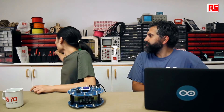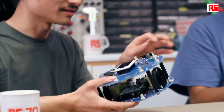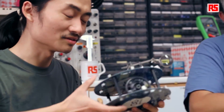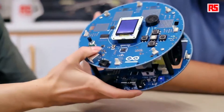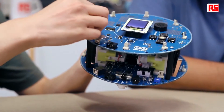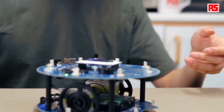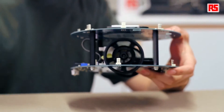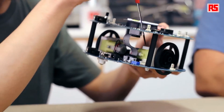Let's first find a small screwdriver that will be necessary for calibrating the robot. As we talked about before, the USB cable actually disengages the motors, so you have to unplug it first, otherwise the motors won't run. Now let's turn on the robot. You can see the robot is running very fast — you can adjust the speed by turning this potentiometer. Let's slow it down a bit, then put it on a flat surface to see if it goes in a straight line. You can see it's turning to the right a lot, and the screen shows a value of 15 from the trim on the bottom, which we can use to calibrate it.